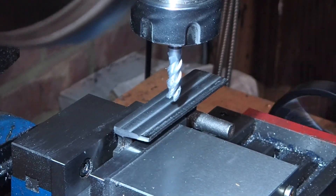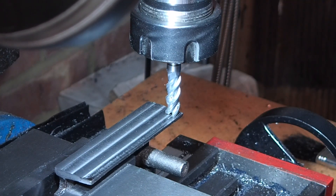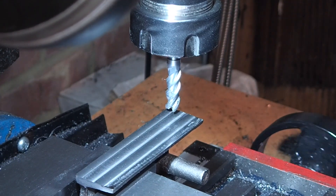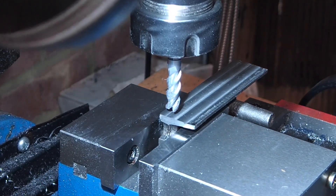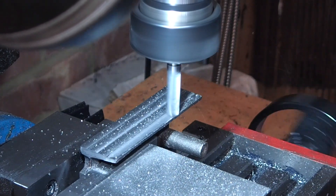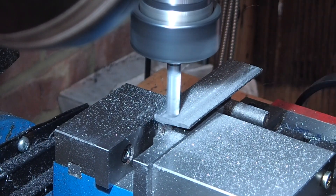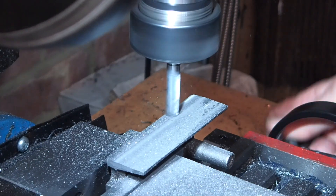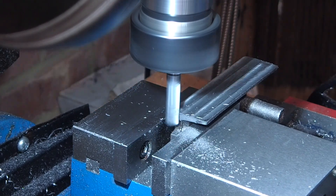To make sure it's still roughly flat I've very gently touched the tool down against the bottom of the casting. Checking the levels on the DRO it's within a few thou, which is near enough. Now I'll just give the bottom a light skim just to make sure that when I clean up the edges the bottom and the edges are truly 90 degrees to each other. Now I'll just clean up all the way around the edges.